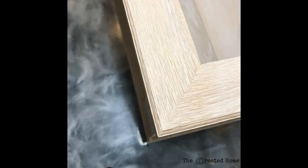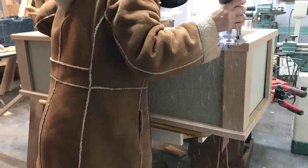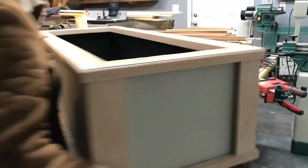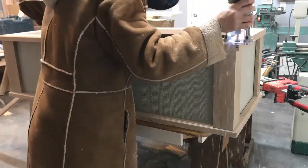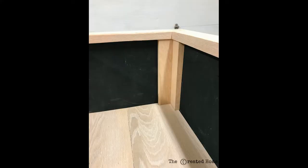The groove fits over the plywood sides, and hopefully those corners will line up nicely. You can route a matching beading profile in that ledge to really up the wow factor. I added extra supports inside the box, mostly because I like to overbuild things, and it looks nice as well. You will also need these if you plan to add soft close hinges so they have something to attach to.